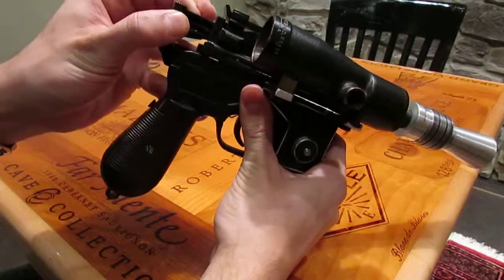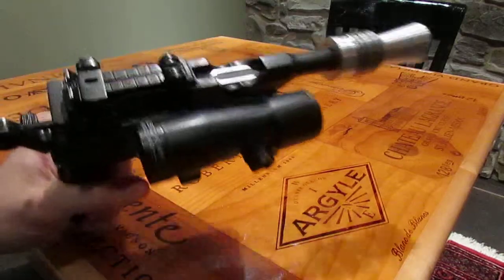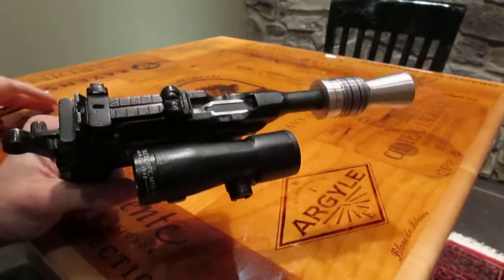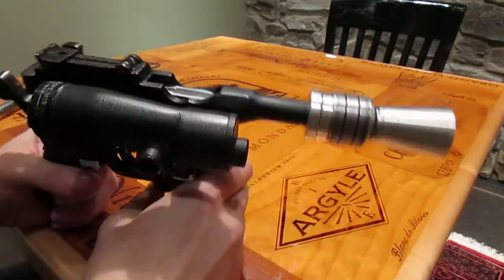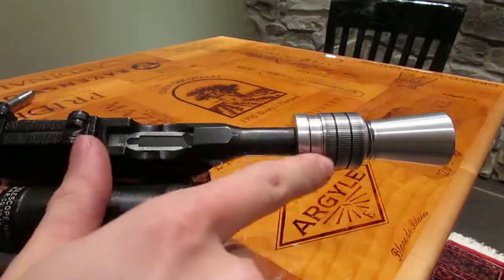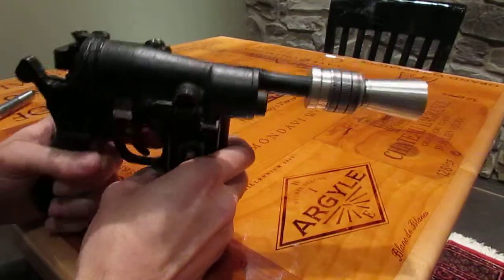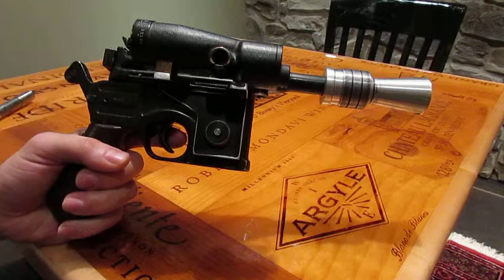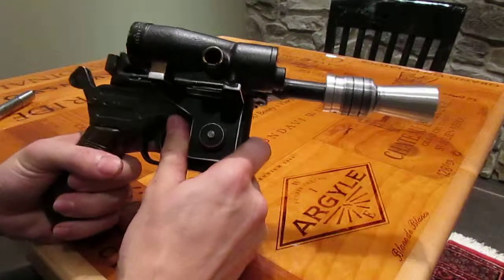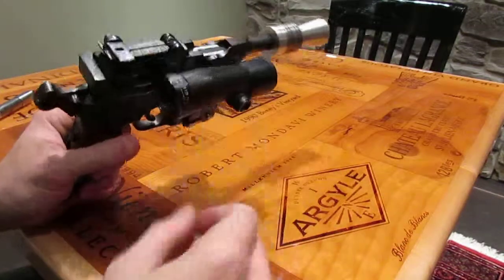Working our way up, we've got a flattened off pin in the back here. I machined this face right in here where the bolt butts up against, flat, and machined a little bit extra off of it because the bolt never sat flush up at the front. You could see there was a gap there. And for my particular style of doing these, that was a problem because I mill a slot out underneath here, and there's a hole drilled through the barrel for the LED wires. So you could see those wires in the millimeter or 2 millimeters worth of space that was there from the factory. So flattening this up a little bit in the back, it corrected that. And that's just part of cleaning up the Denix cast, which is quite awful, but can obviously end up making a pretty dang good replica.